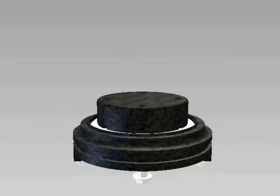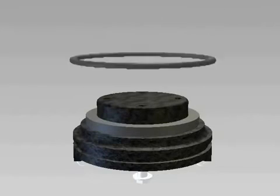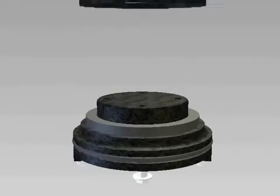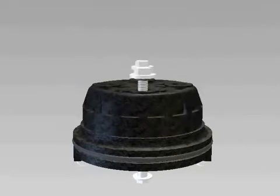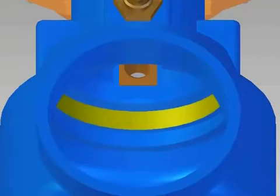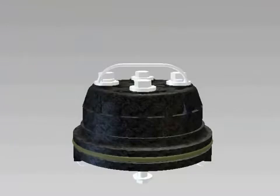Replace any damaged parts. If you are installing a repair kit, replace the seal ring, seat O-ring, and bolt O-rings. Reassemble the check and tighten the retainer bolts evenly. Clean and inspect the O-ring sealing area in the body. Lubricate the seat O-ring.